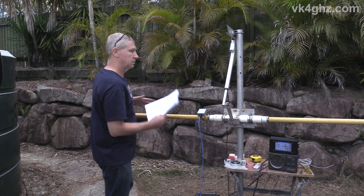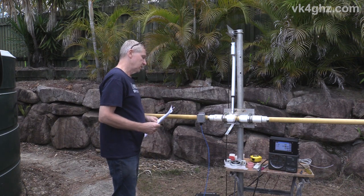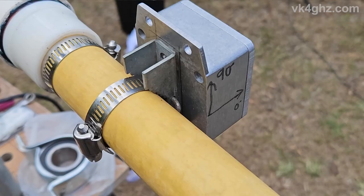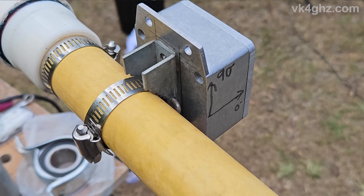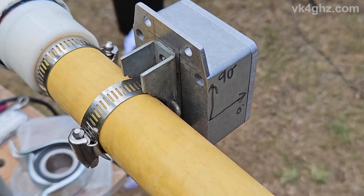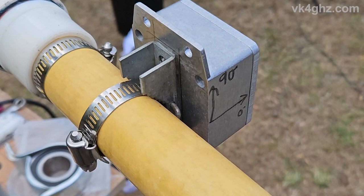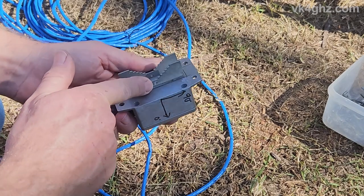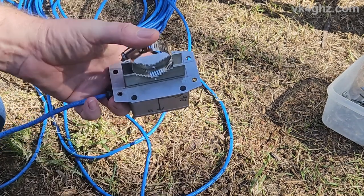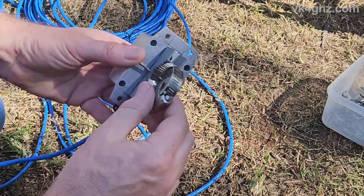On the back of the sensor box, I used JB Weld two-part epoxy to glue on a V-clamp, which helps it locate and sit on the tubing. It was a bit awkward to get a U-bolt to hold it on, so I ended up using a stainless steel hose clamp, and to keep that in place there's a 3mm pin — I drilled a 3.2mm hole in the V-block. Those pins are just pegboard bracket leftovers.